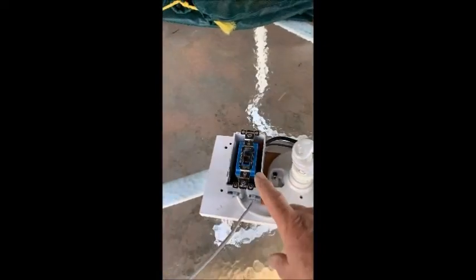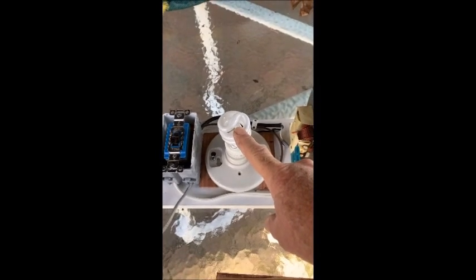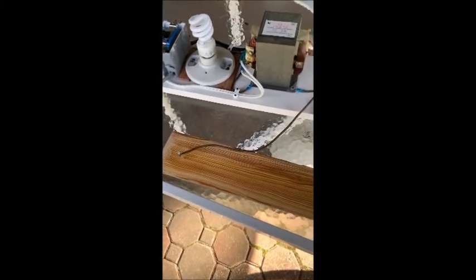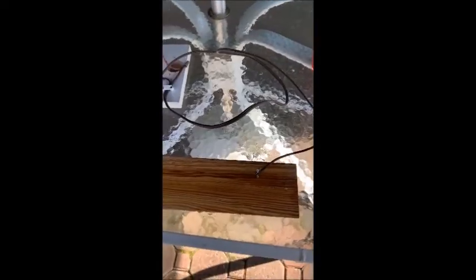Just to show you that the wire is unplugged — here's what I did. I have a standard wall switch that when flipped on will light up this compact fluorescent light, so we absolutely know whether there's power to the transformer or not. This is the transformer I just took out of my wife's new microwave. I have the electrodes attached to two aluminum nails — aluminum is a better conductor than steel nails. I've painted the wood with a solution of baking soda and water to get good conductivity. I'm ready to plug it in and give it a try.